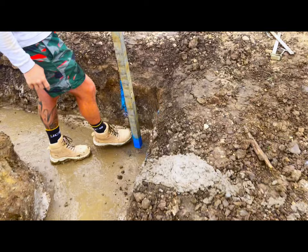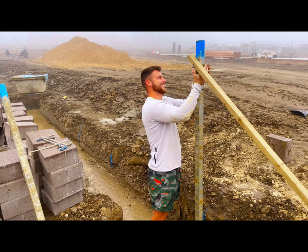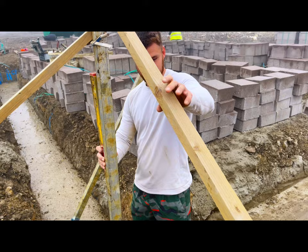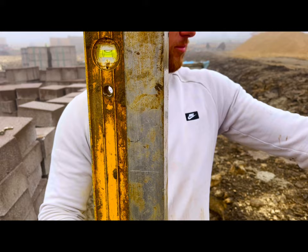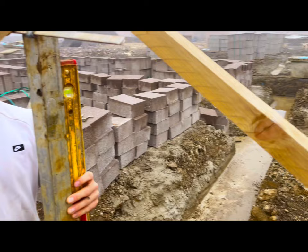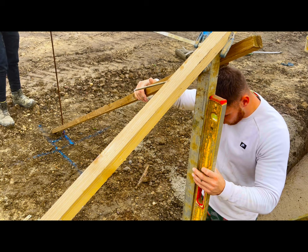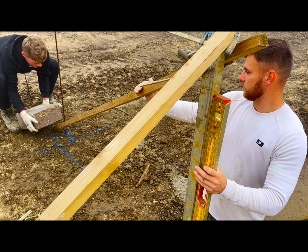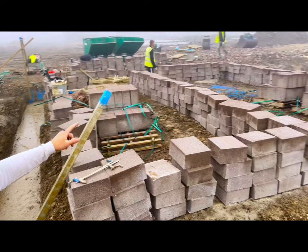So you've just got to make sure you get that pin on the corner. Now you'll just have to plumb it up, moving your stick, making sure that profile's still in the corner of that pin. Then get your assistant to put some weight on it, nice and gently. I'm trying to keep the profile as square as you can as well. That pin's in tight all the way — that's sound there. And all we need to do is repeat our process on each corner.